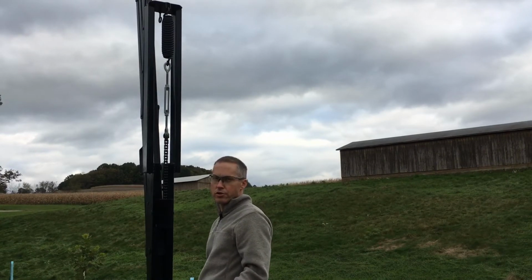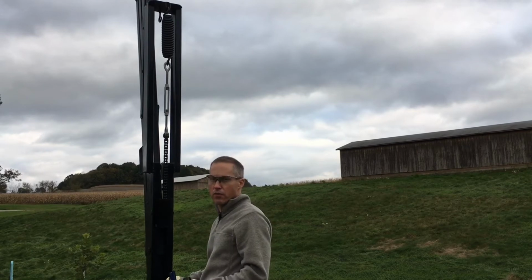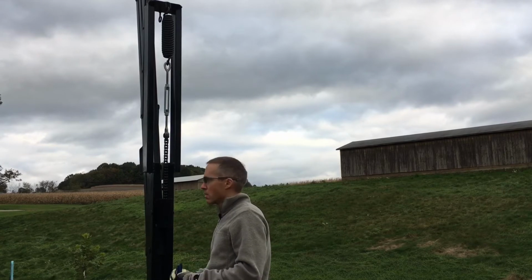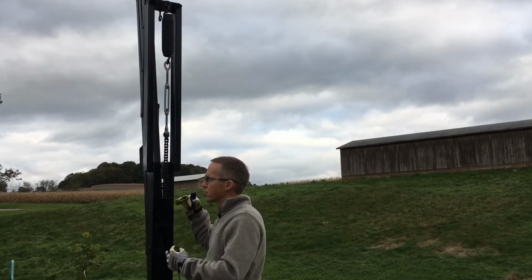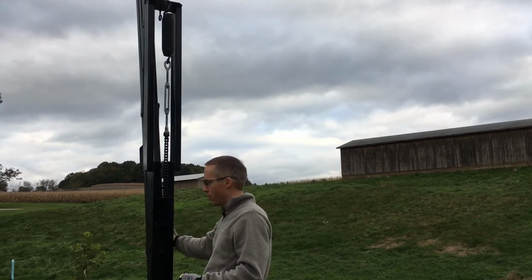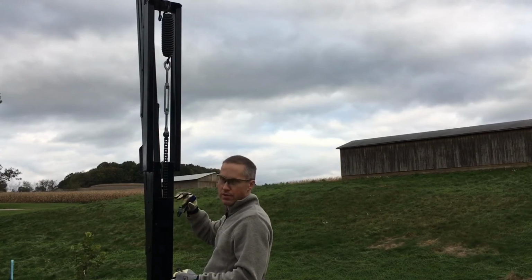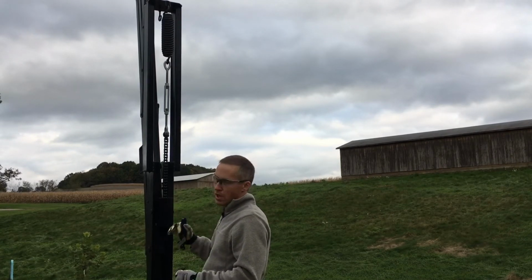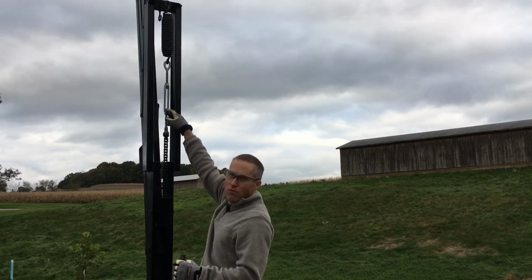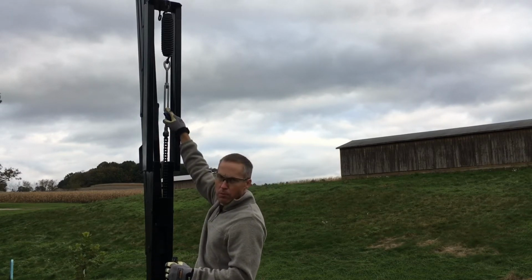Adjusting spring tension on your KEG gate is going to be necessary after installation as well as periodically over the first weeks to months as your spring stretches. After installation, once you've reattached your chain, turnbuckle, and spring, your helpers will still need to be holding the gate open, and then you'll need to adjust the turnbuckle tension. Initially, after installation, we recommend that about 4 to 6 threads be showing on either end of the turnbuckle bolts.